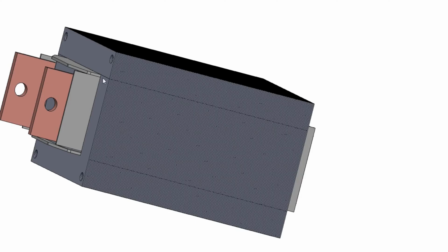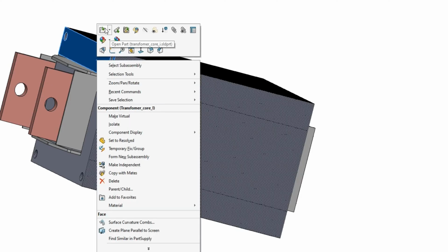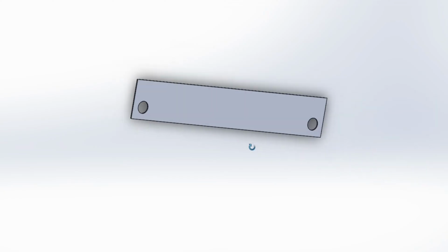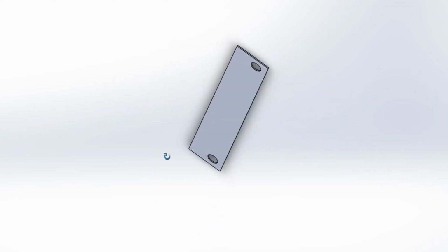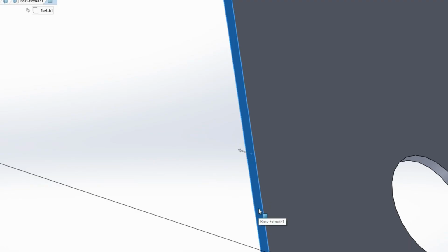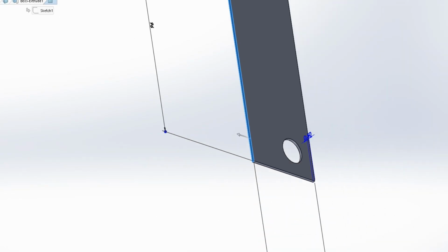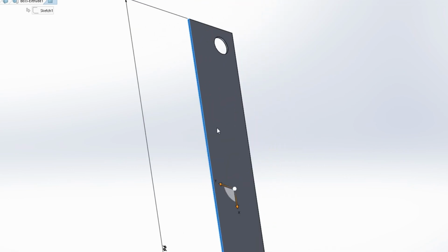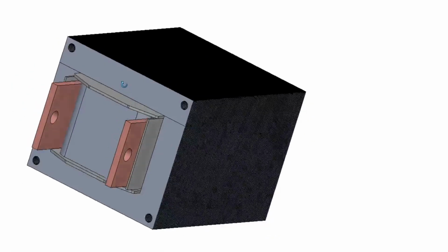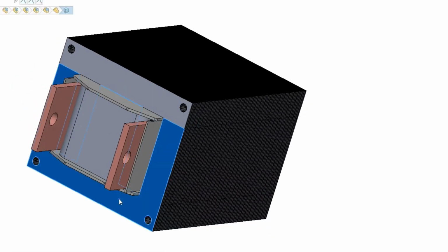So basically these plates, let me see if I open one up. There's the I, and that's basically what I've purchased. Them two holes are on the outside and this is the inside, so this is where the E meets here. The E meets this face tight, a really tight butt joint. Really tight. The tighter the better, less losses. And I'm going to show you the E now. I go back into the assembly. And the E is here.